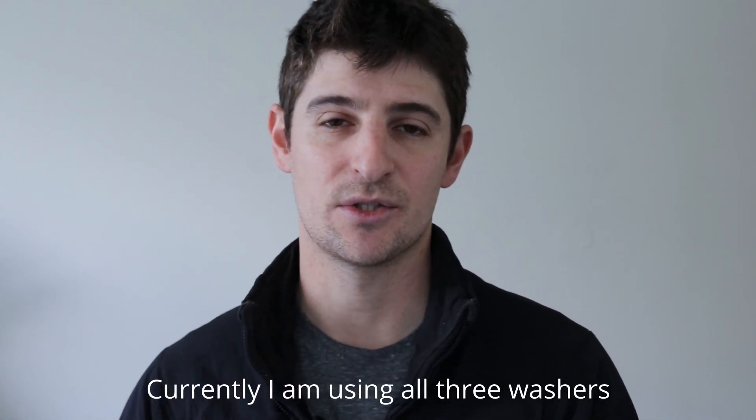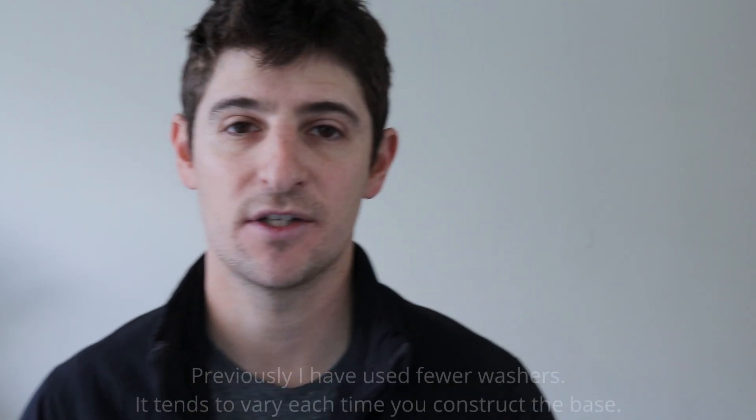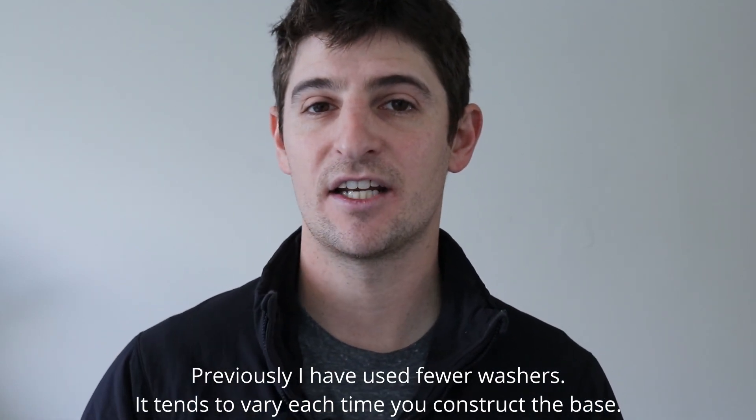What about if you're seeing consistent errors, usually between 0.5 and two or minus 0.5 and minus two? This is a really common problem and it's to do with the installation of the vertical stop behind the telescope, which incorporates this thumb screw and these three washers. When you first install it, the manual suggests to use one large and one small washer. If you're finding values that are consistently around positive two, that means you need to add more washers — maybe add that third washer in, or just try two of the big ones. Conversely, if you're getting numbers between minus 0.5 and minus two, that means you need to take away some washers. Just play with that a little bit. If you're getting consistent errors, it's actually a good thing — it's a pretty simple fix.